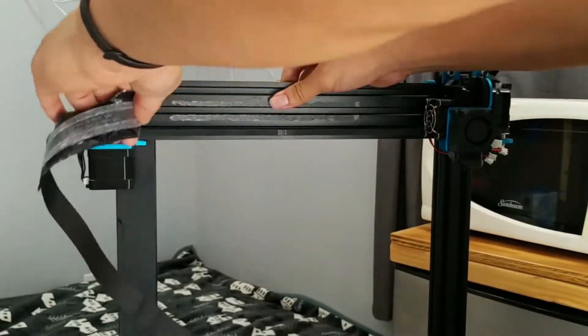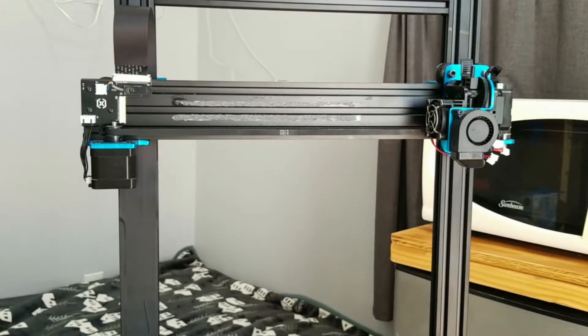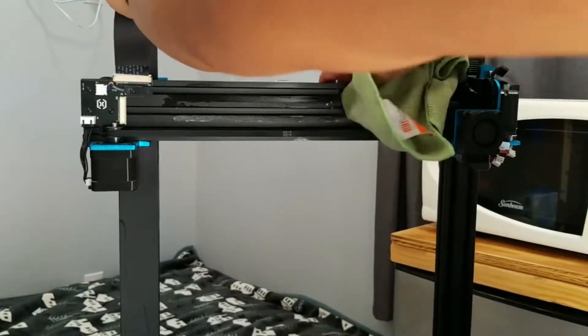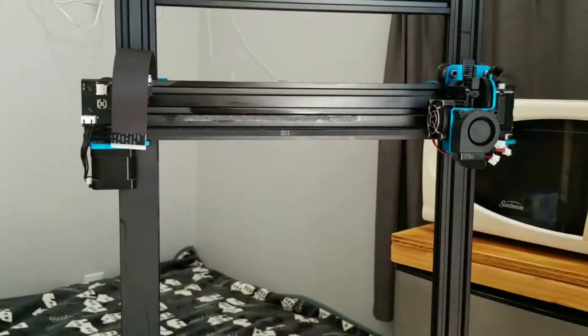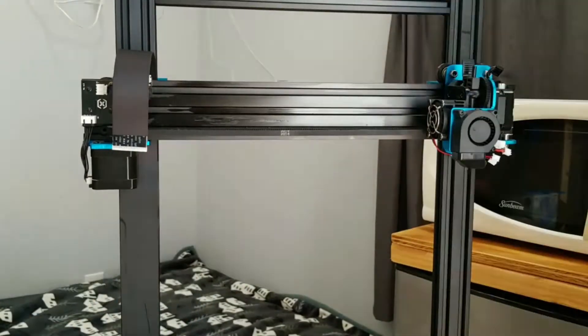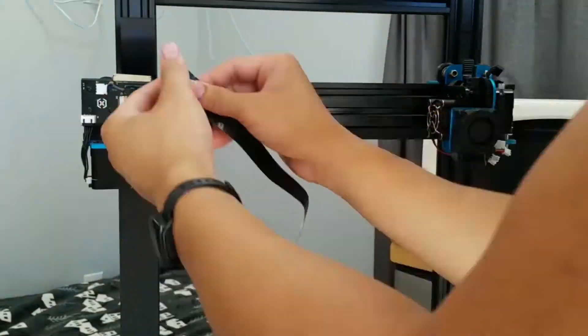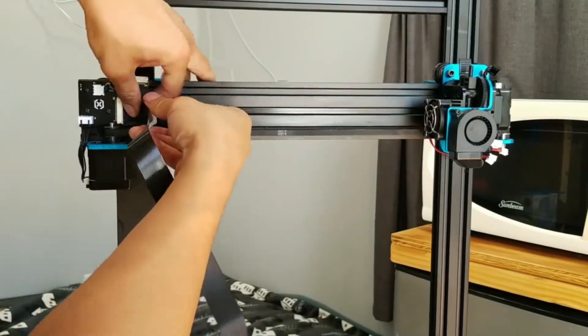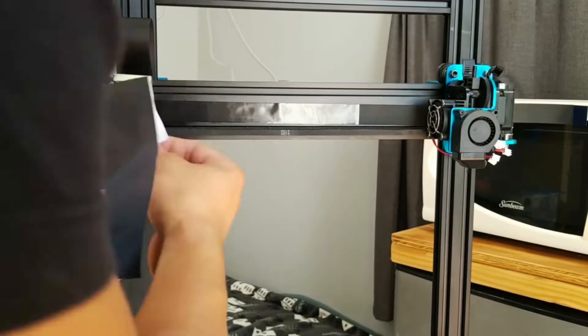I'm going to slide it over to the right and then remove the ribbon cable. I tried various different methods of trying to get the sticky stuff off — I went with the nail, razor blade, and then ultimately went with Goo Gone. Once I get all the sticky stuff off, I start the process of putting the ribbon cable back on, trying to do it as parallel to the extrusion as possible. When you put the tape on, you want to make sure that it's as long as the previous one, because the extruder head needs to be able to slide left and right without peeling up the tape.